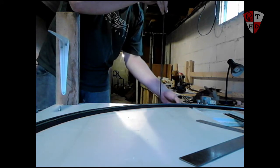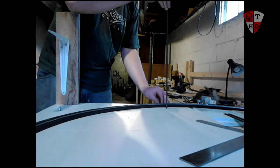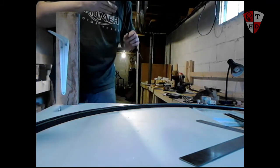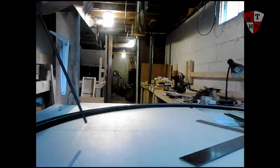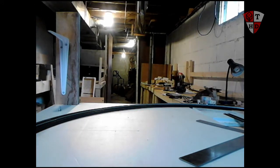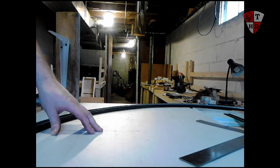2x2 because I got a 2x4 stud underneath that. And place one over here. Then same thing with this side, make the little bridge across. And then get clearance over here for this midsection. And at some point, I want to cut these ones down to size, because I'm not going to cut them down all the way, but we'll reuse them. So that will set up for that side.